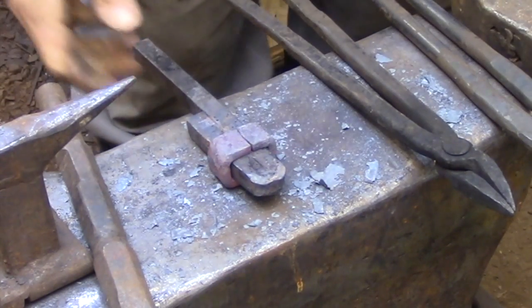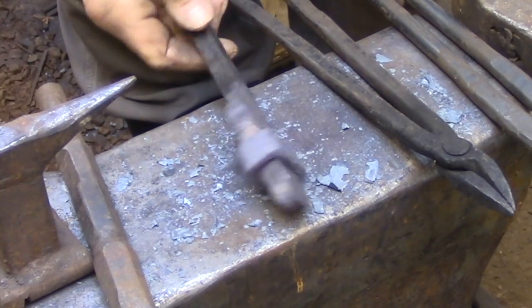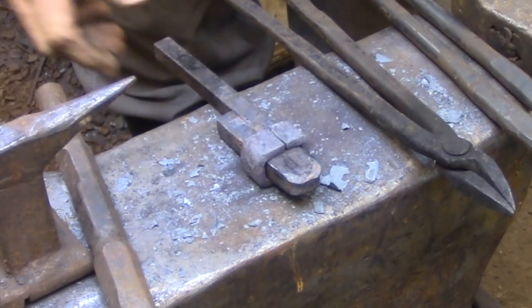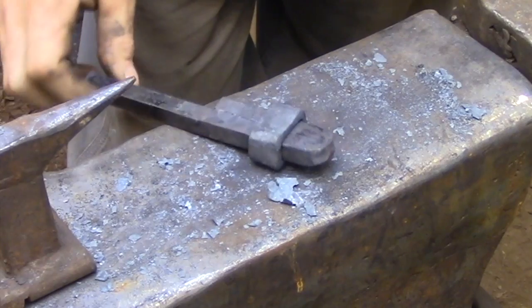Remember, this collar is in the center of a railing, so you're not going to be able to spin it around to hammer the different sides of the collar to get it set. You're going to have to rely on the mandrel being the right size for the collar, so when you squeeze it back shut, everything's right.